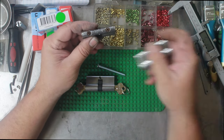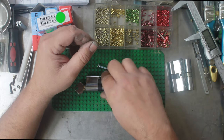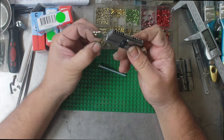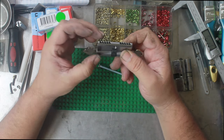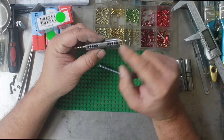This is a one-piece cap setup. This is a two-piece cap setup. With these ones here, they generally don't come off in caps. We've got a couple of different options. One, we can remove the circlip, flip the key around, and use a yoke jig to hold the top pins. That's one option. On these ones here, they're designed with Allen keys.